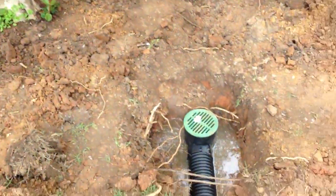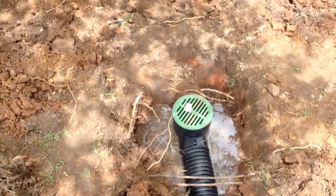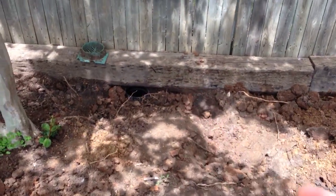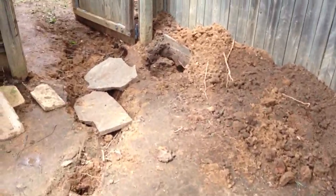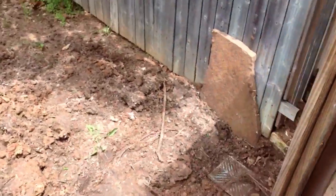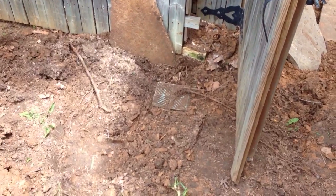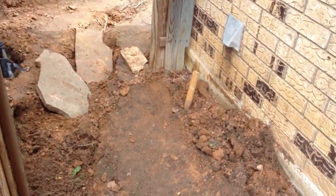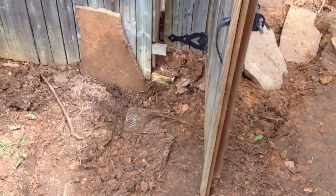Right here next to this crepe myrtle on the fence, we've got one that was existing already that we had to uncover. The hose goes down and then kind of comes back up and reaches underneath the railroad tie to a catch basin there. That one continues across, around to the side of the yard. Another catch basin right there — we'll have to dig around and clear that out. But that guy is right next to the fence and the sprinkler head, so that'll be great. Now all that water can route there.